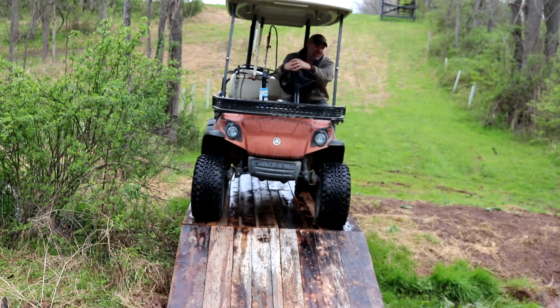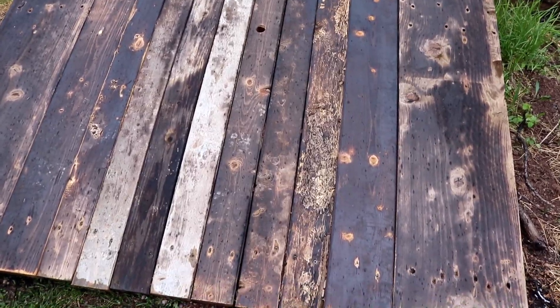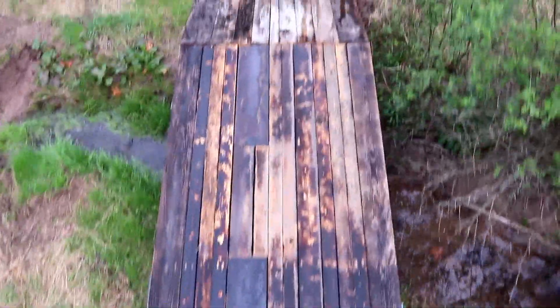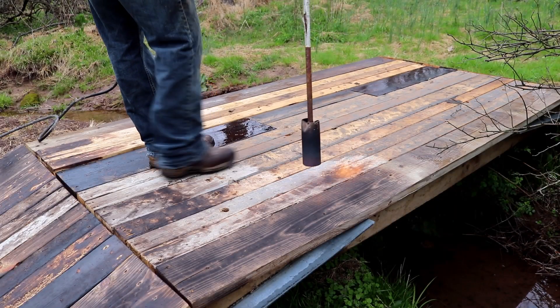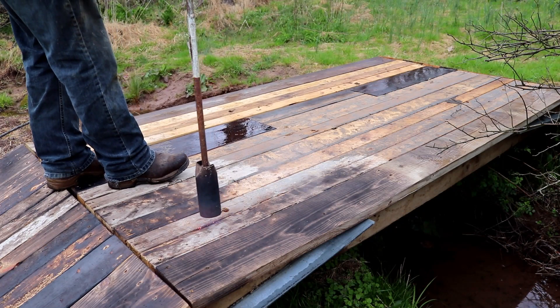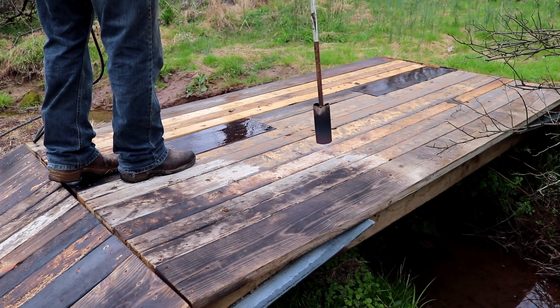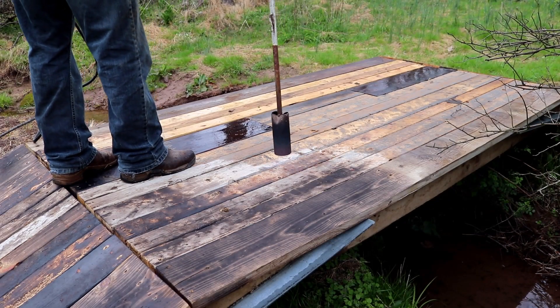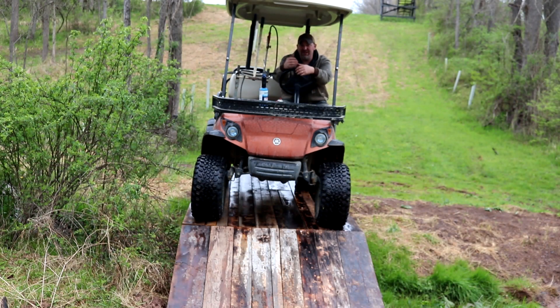There you go — that's why I burnt my bridge. I think it turned out pretty good; it really brings out the grain in the wood, looks pretty nice and a little rustic. I'm curious how long it's going to last and how effective it'll be. If you have any experience doing this or know how long it lasts, please leave a comment. If you decide to try this, please exercise an abundance of caution. It took me quite a while tonight because of the rain — I had to dry off all the wood with the flame before I could actually heat treat it. I did that because I wanted the surrounding area to be wet, and I have creek access right here in case of an emergency. Please do not do this on a dry, windy day or near boards attached to your house.